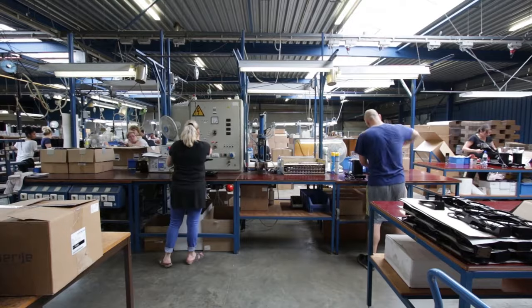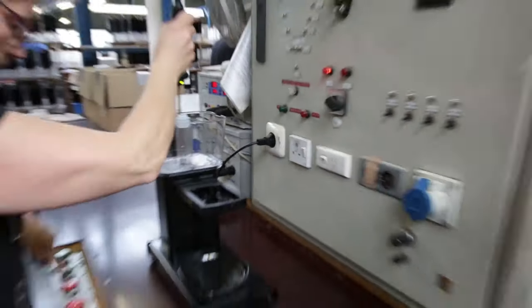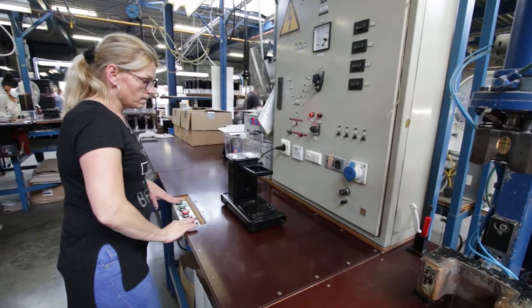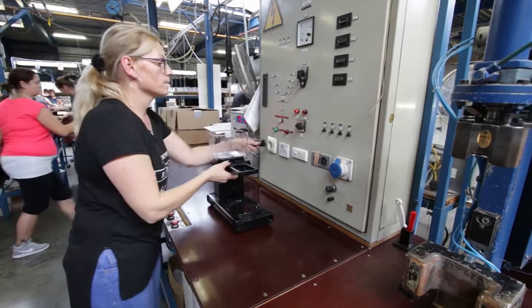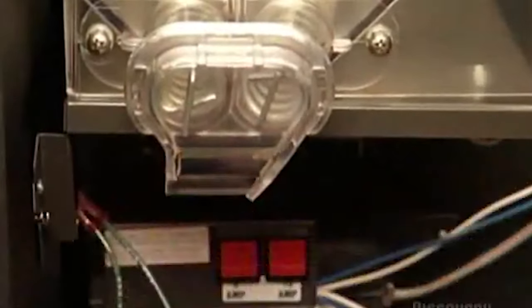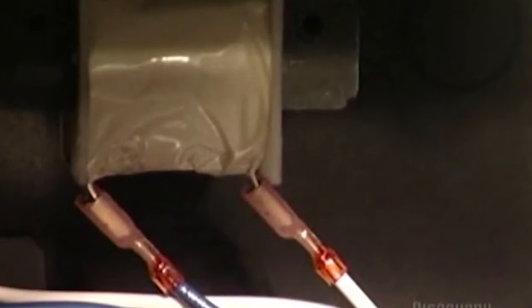Next comes the hot plate where the glass carafe will rest and can be heated. Next, a column is built which contains the heating elements and the cold water container. While automation streamlines most assembly tasks, some intricate operations require manual intervention. Skilled technicians handle delicate tasks like wiring electrical components and calibrating mechanisms.